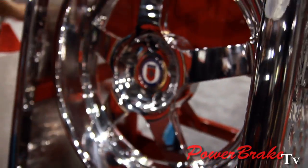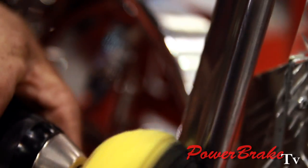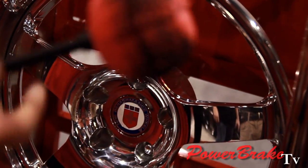On the stainless steel we have here, you do the same thing. Go back, use your Powerball MD, put it on your drill, and work your stainless. You're going to polish that stainless steel really, really nice — bring it up to almost a chrome shine. Work that back and forth, then take your microfiber, take one wipe, turn it over, and polish that to a shine.